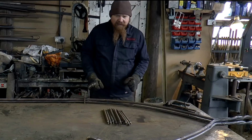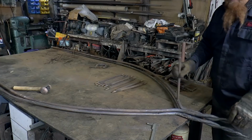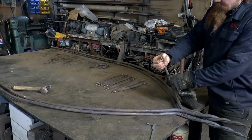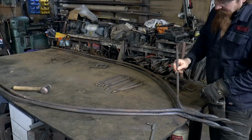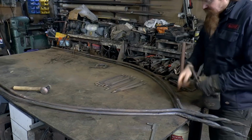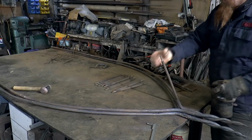So with this type of construction, this riveted construction, these bits here go in the hole, they're a loose fit, and the idea is this bit's going to be heated up when it's inserted, and then I'm going to hammer the top bit here, which will fatten out this bit. So where it goes into the hole, it's actually going to lock in there as well as on the top. So unlike a bolt, for instance, which clamps from one end, or if I was to weld it, so if I just offered up bars on there and welded them, they would just be fixed at one bit. When you properly rivet something, it fastens all the way through the joint, so it's actually quite secure.